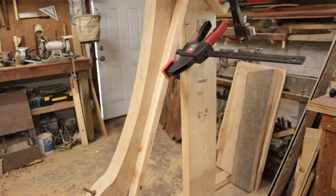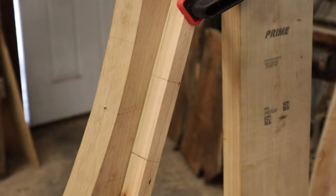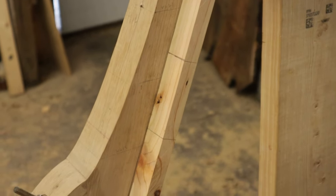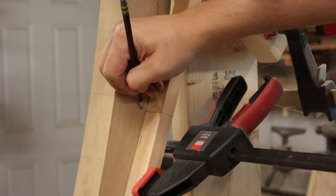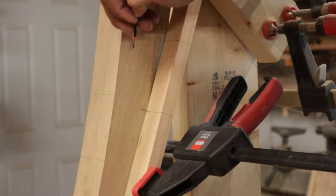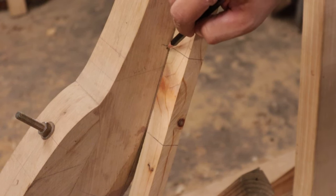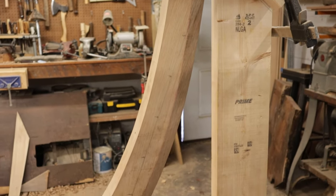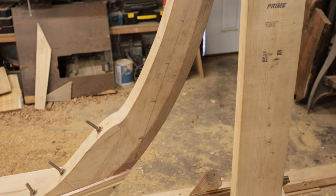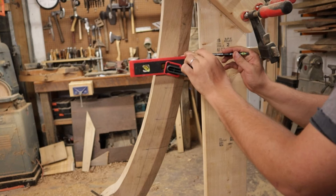So in order to line off at the stem, we clamped the batten to the stem to function just as that diagonal line did in the diagram. We subdivided the length of the batten into eight equal segments and then transferred those marks to the stem. We then projected those marks to the front of the stem using a small level as a guide.